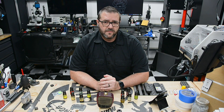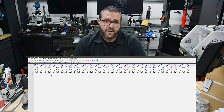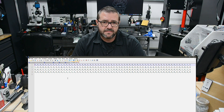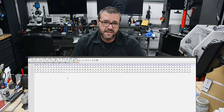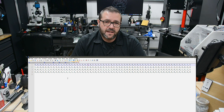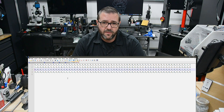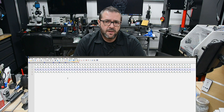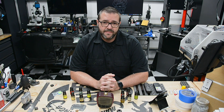Next we'll set up a video file. With it still winter and Valentine's around the corner, let's set up a couple romantic videos as well as one or two winter vids. Once I have a video, I create a text file with the same name except with a .dat extension, then create a row for each minute of the video — each row consisting of 60 comma-delimited values. I start off with all zeros, then change the values at the right time to introduce the scents that sync up with the video — for example, campfire during fire scenes and forest pine for outdoor or garland scenes, cupcake and sugar cookies for food scenes. Another cool feature is that you can mix scents by alternating two scent positions back and forth, like alternating 4 and 5 for a minty woodsy smell — great for a winter scene.